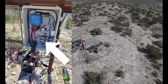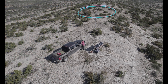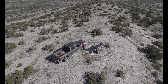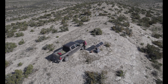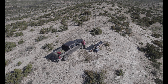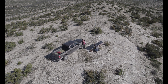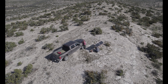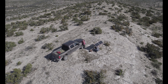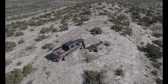We also have a 5 gigahertz omni-directional antenna on top of this tower, which allows for broadband connectivity to the top of this point and broadcasts throughout the overall radius of this ranch. We take a broadband connection from a lower point in town, and that shoots up directionally towards this omni-directional antenna. Then as long as anything throughout the ranch can see this point, we can put broadband communication systems there for camera systems, other sensors, and a lot of different things.